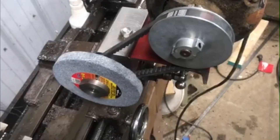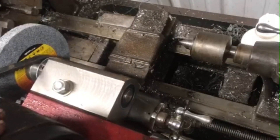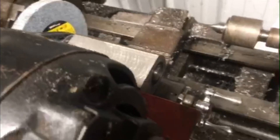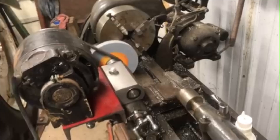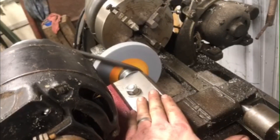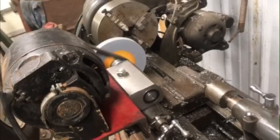I've done an awful lot of grinding at work without one through the years, but I should have one. I've also got to come up with a way to mount a wheel dresser up here on the bed so that I can dress the wheel and get it true. We'll plug it in here real quick and you can see what she turns like. It doesn't feel too bad — it's not perfectly smooth, but the wheel's not dressed. We'll just have to try it and see.